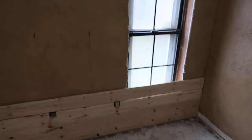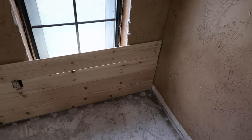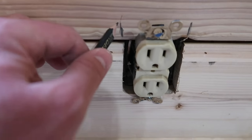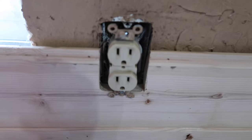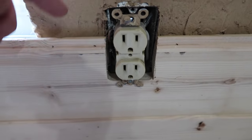There you go — that's it. You got that cut, and you're just going to do that for those other two. Set it back up here and then you're good to go. So what I did again is I just got my length — it's pretty much been the same length all the way up. Whenever you're cutting these, you are going to have some little spaces on the end. What we usually do is run a little tiny trim piece — I'll show you at the end — so don't worry about those cuts. We get it as tight as possible, but don't freak out. So I went back, put my piece back up on top, got that cut out, pulled these outlets out from the wall, and marked right there. I'm going to measure up right where that tongue stops to the edge of this box, get those cut out just like I did earlier, and stack it back on top.